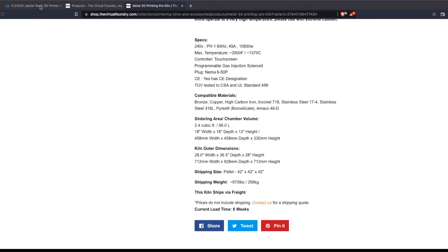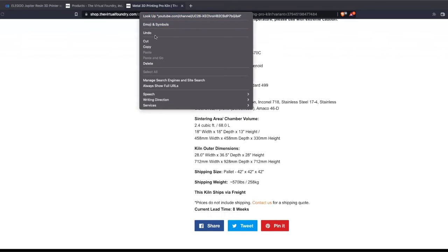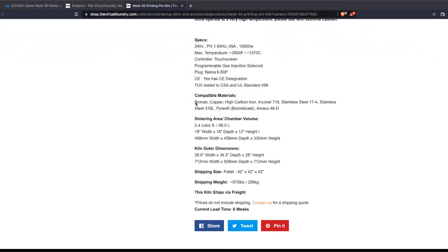The reason is the powder near where the laser is sintering is still being heated, so for consistency in material properties, they only allow maybe 20% reuse — the rest has to be virgin, or 50/50, whatever that mix is. I did just hear on a podcast that there's a company with powder bed fusion where you can basically reuse the powder a near-infinite number of times — you just have to strain and filter it to make sure there are no chunks. But you'll always have waste at some point. You think resin's messy? That powder — don't sneeze.